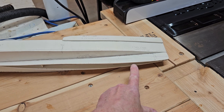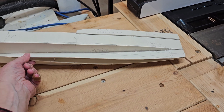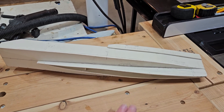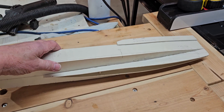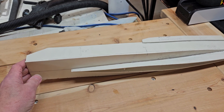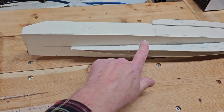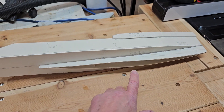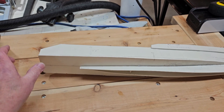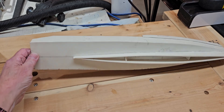The longer and narrower a hull is, the less resistance it has going through the water. If you've got a Boston Whaler, Aqua Sport, Mako, or something like that, you just give it gas and pop up on a plane. With a boat as long and narrow as this, it will travel at a much higher speed without creating that big hole in the water. And when you do go up on a plane, it will plane off very easily because it's so long and so flat aft.